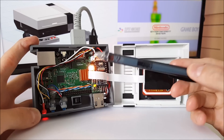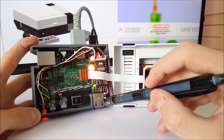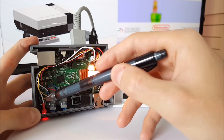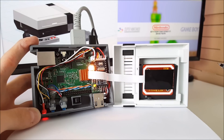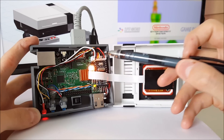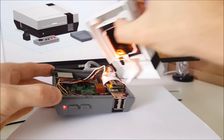Here are the insides. I have the Raspberry Pi board there. I had to remove the USB ports - I moved two of them to the front, and the other two are used for WiFi and Bluetooth dongles. The indicator light and the switches are wired to an Arduino, and that's also wired to the cartridge slot. The cartridge slot is an NFC reader, which allows me to read data from an NFC tag and determine which game I should be running. The light shows the status of the cartridge slot: orange means an empty slot, green means a good cart, and red if the cart's bad.